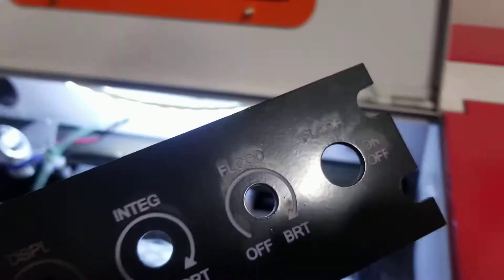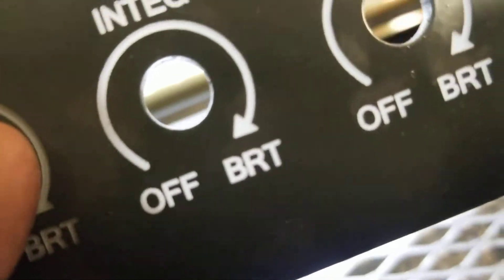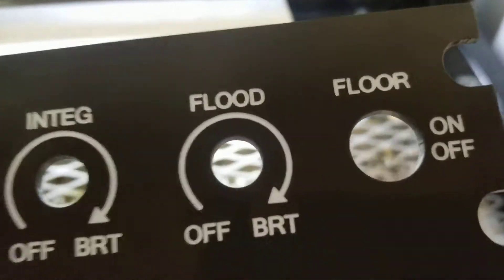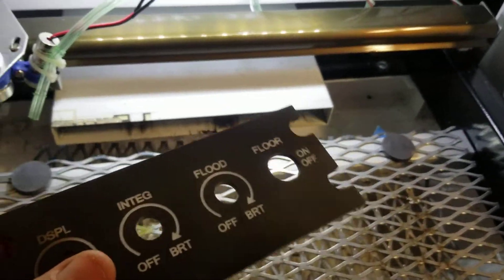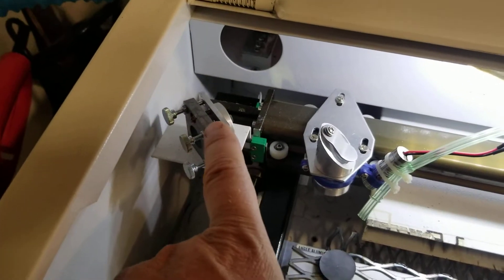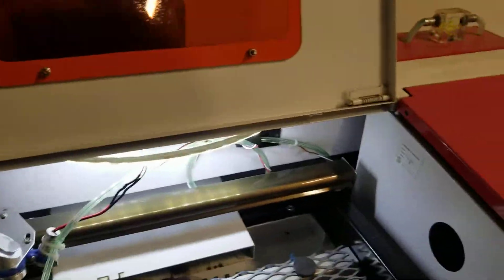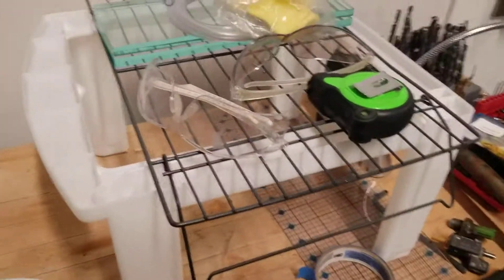What'll start happening is if that lens gets dirty, you will not have clean lettering — it's going to look all fuzzy, like a shotgun was fired off to make the letter. If you start seeing that happening, it doesn't mean your machine is broken or the focal point is incorrect; nine times out of ten it means that laser lens needs to be cleaned. You're also going to need to watch a video on YouTube on how to get your laser in focus by making a few adjustments. Don't get too afraid — this is actually real fun once you get it set up.